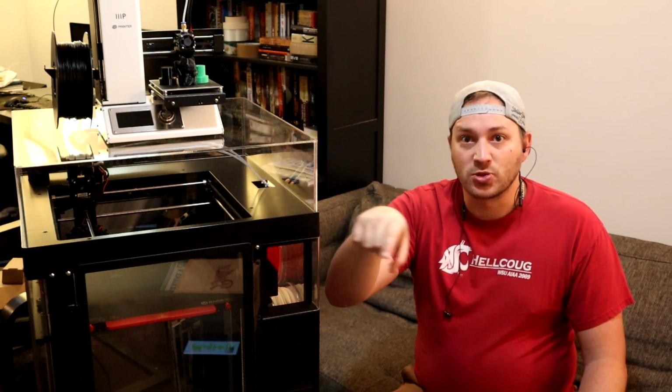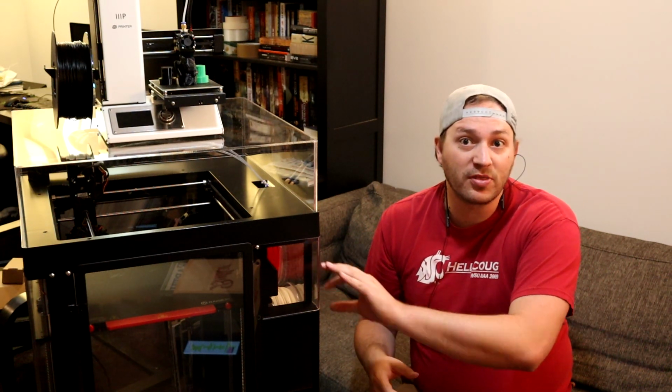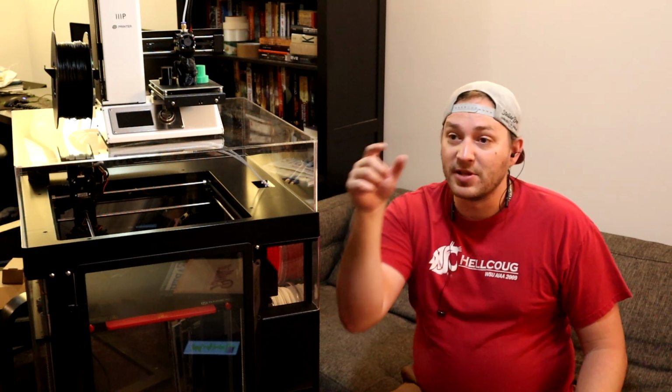It's essentially a laser, legitimately a laser, that gets directed by mirrors around a build volume over a layer of, in most cases, nylon. The nylon is then melted together into a part, and then the machine puts another very small, very thin layer of nylon over top, and the laser comes back and melts layers and layers and layers and builds itself up. Really cool, can do internal voids really well.